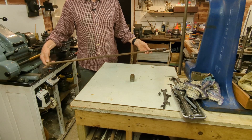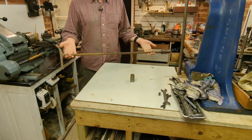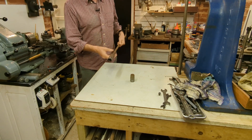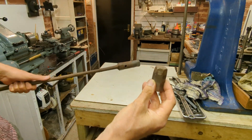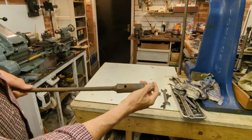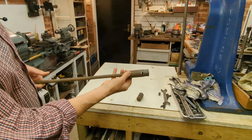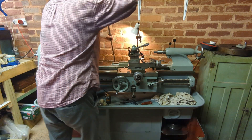To reach the jack right at the back, I made a long-handled box spanner. I found an old services-type wrench and a box spanner that wasn't quite the right size, so I milled a small taper drift, heated it up, and forced it over the end to give the right size. For now it's just wedged on there, but I'll probably pin it or weld it. So I'll show it in use — the box spanner can be reached right over the top of the lathe.